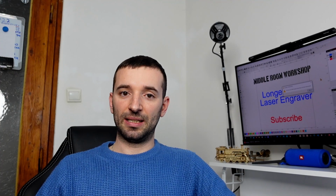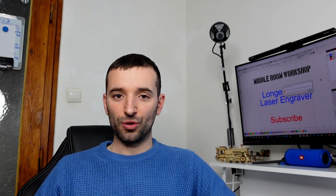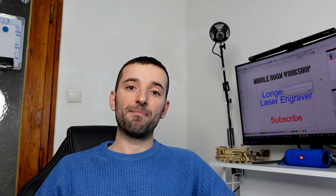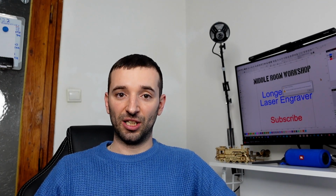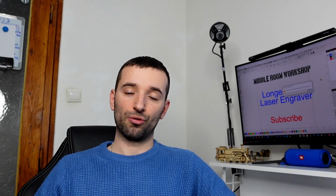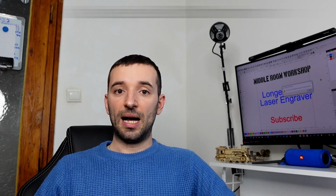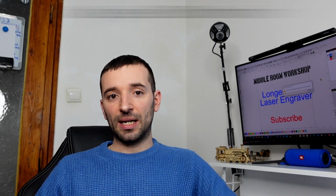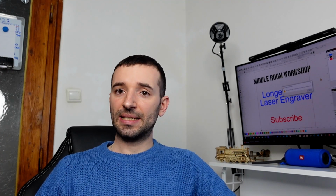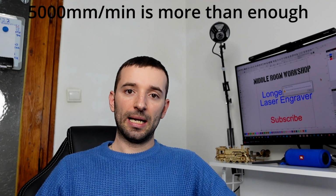Alright, let's now talk about performance. The machine comes built with a 32-bit microcontroller with a clock speed of 240 MHz. Now, this might not be one of the most interesting features for most of you, but bear in mind that's what makes the machine fast, because having faster computational power with a 32-bit microcontroller, you can engrave faster. And so, speaking of which, the machine is rated for a top speed of 6,000 millimeters per minute. Now, if you're following my channel, you know that I usually say this: as long as a machine can reach 5,000 millimeters per minute, you are basically good to go.